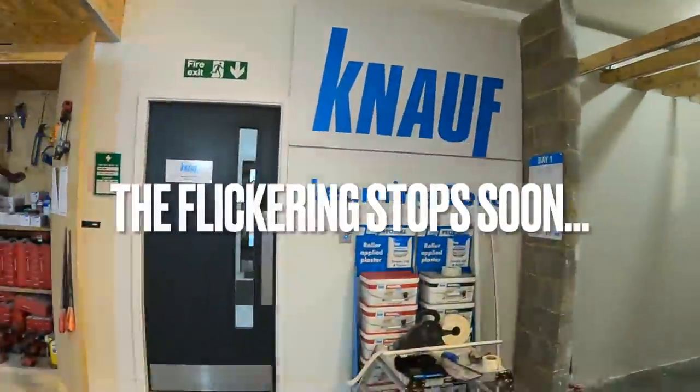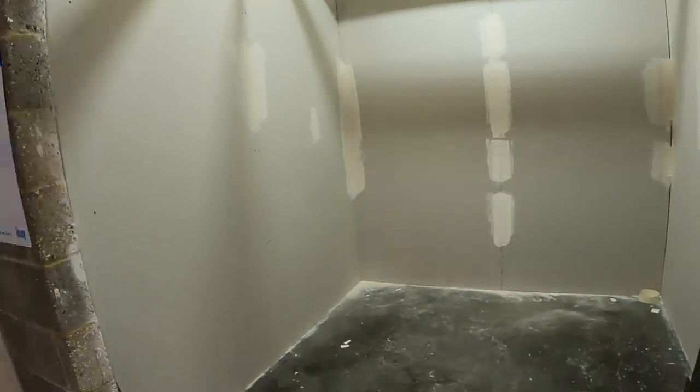Just got here and we're taking as much footage as we can. I'm going to give a brief introduction to spray plastering — again, this is totally new to me, never done this before. I'm going to hone in and get as much detail as I can from the trainer at the training center. Hopefully in the future we can take this further. One thing with airless spray plastering I'll say straight away is you do have to fill your joints before you do it. That's going to put a lot of people off, but I guarantee when we see how this works we're going to be pleasantly surprised.